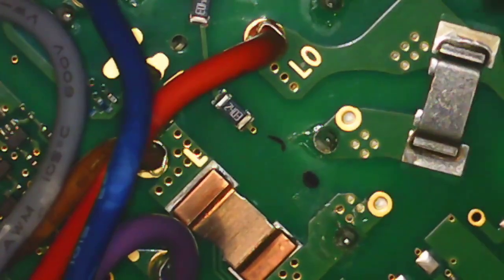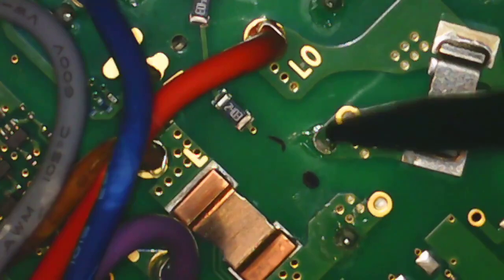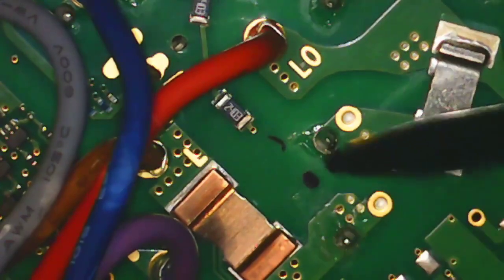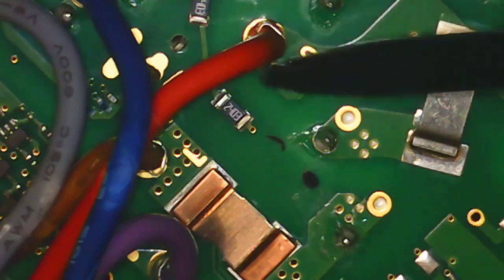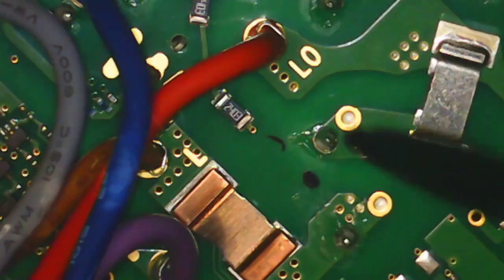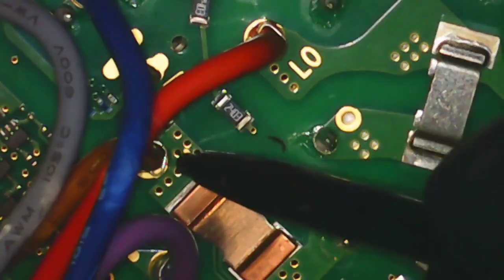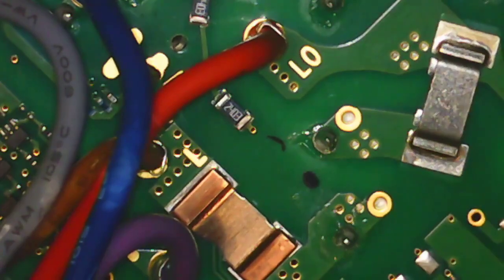Live in goes into one of the contacts of the relay. The relay is fired by a low current that's given to the relay by the MCU, and then what happens is that those two contacts are connected, and we come through this fuse, and that goes to your light and switches your light on. This whole entire controller unit, its main purpose is to switch that live in to that live out. That's it. There is no other reason.